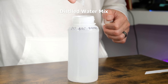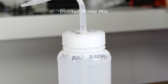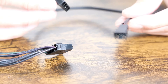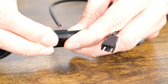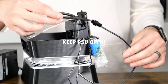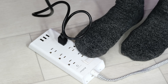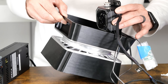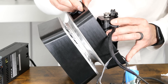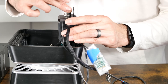I only put biocide and distilled water in my loops, but you can use whatever coolant you want. To fill and bleed the system, I'm using a spare power supply with a jumper and a molex to fan connector in order to power just the pump and block combo. You never want to run any pump dry, so make sure your power supply is off before connecting everything. I like to move the PC around in order to speed up the bleeding process — small form factor PCs are easier to bleed than larger PCs because of this. I used my feet to quickly shut off the pump if it ever sucks air in. I filled, bled, and leak tested the system for over 24 hours.